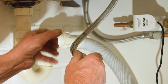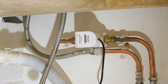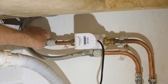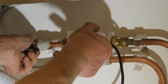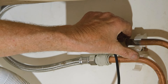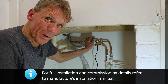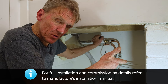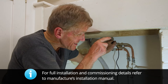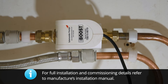That's nice and tight — that's fine. Final bit: put the push-fit adapter on to the end of the hose. These don't need much tightening because they've got a nice squashy rubber washer in there. Push nicely on, clips down. Now that's all connected up. I can turn the water back on and then deal with the electric. They're going to put a plug and socket inside this opening here, just tucked up there, and get the electrician to come and run another point.